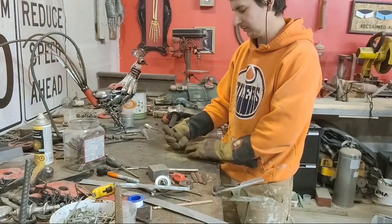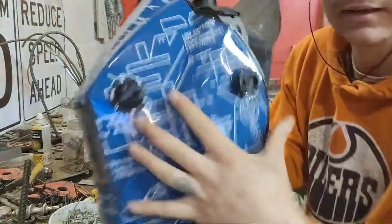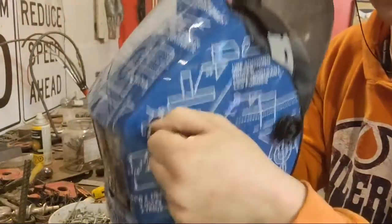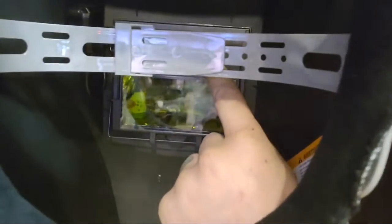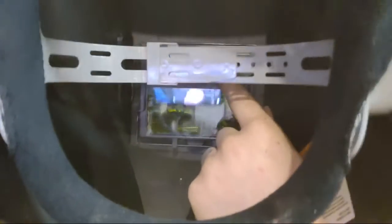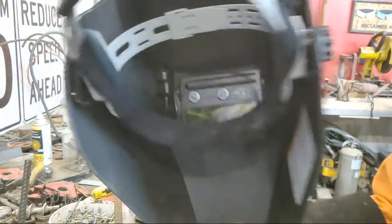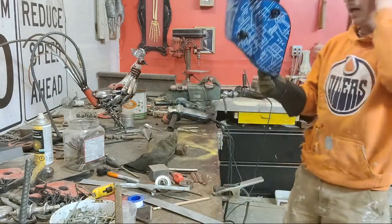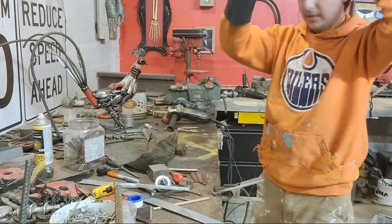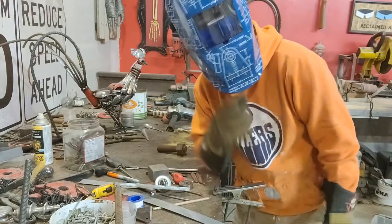Okay. Janice RC said, I didn't know welding helmets had settings. How does that work? Right here, if you can... No, right here. You can see that it can go darker all the way to grinder. So if you put it to grinder, it won't darken, and then you're still able to see. Let me show you that. See how that goes dark? That's basically what happens when it sees a spark. And there's other settings in here that will linger. The darkness will linger in case you're sensitive to bright lights. So sometimes when you're welding, actually all the time, it heats up and it creates a glow. And sometimes that glow can hurt your eyes. So you can adjust when the auto darkening goes back to normal light. When you look through here, it looks like you're looking through sunglasses. And then as soon as there's a spark, it goes really dark and you can't see anything except for your arc.